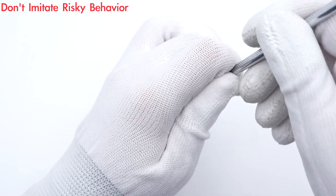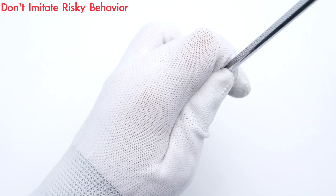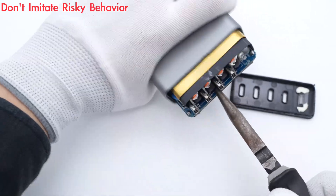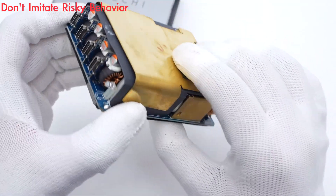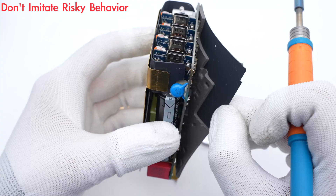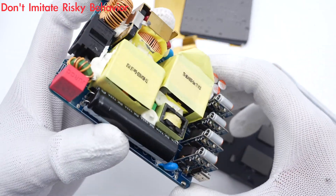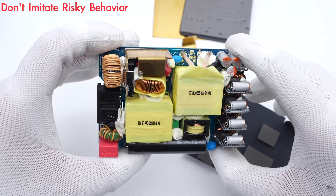Next, let's go ahead and take it apart, starting from the upper panel. After removing the upper panel, the entire PCBA module can be easily pulled out. The front and back are wrapped with brass heatsinks, and a black mylar sheet for insulation is under the heatsink. There is a layer of thermal pad between the internal components and the mylar sheet. The gaps between components are not filled with silicone adhesive, so space utilization could theoretically be further improved.